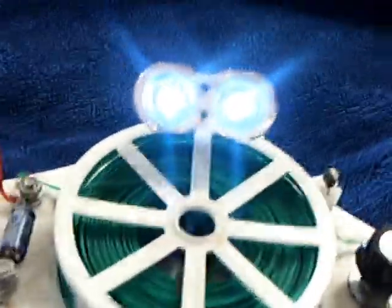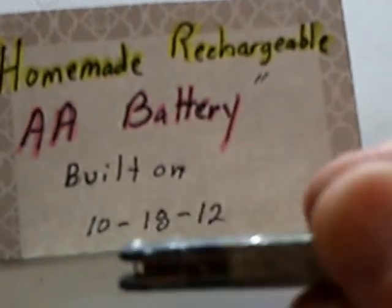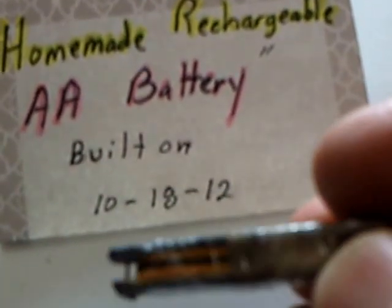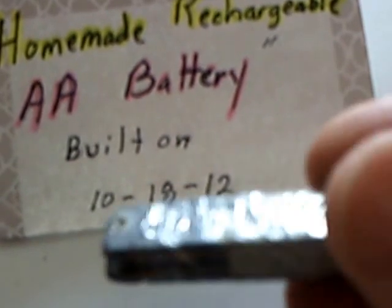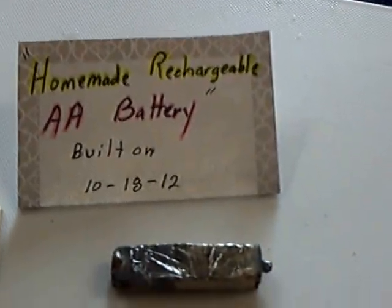This blocking oscillator takes 30 milliamps to run it. And this flashlight is no wimpy thing either — it takes quite a bit of power to make it go. It doesn't run it very long, but the fact that it runs it at all was quite impressive. I just wanted to report back on these homemade rechargeable AA-size batteries made with linotype lead — a lead-based metal with a separator and the lead oxide and water. Another one of the success stories. Thanks for watching.